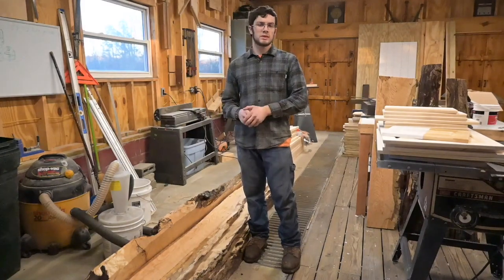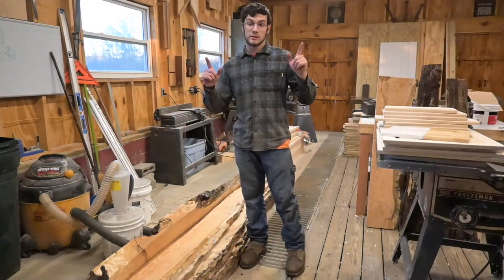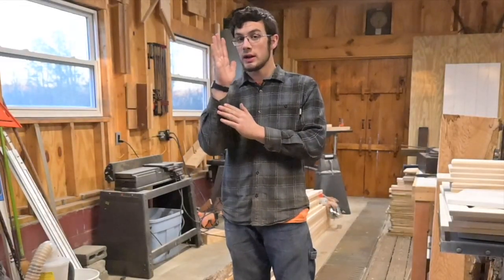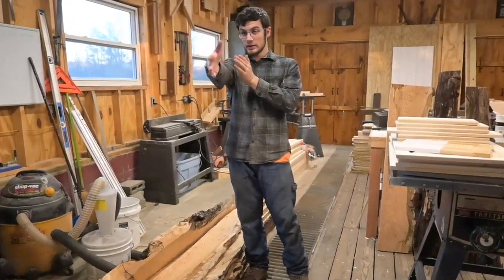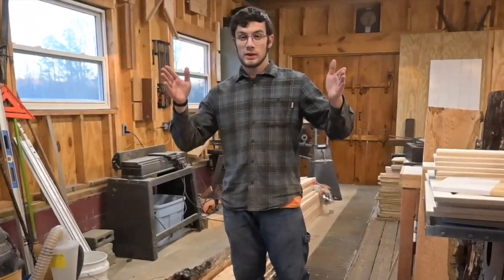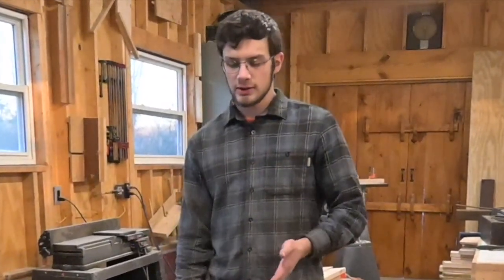Okay, so here come the disclaimers. I don't know what I'm doing. Don't do what I'm doing. This is not a how-to. This is just what I did. A couple things to keep in mind when you're doing it is make sure it is flat up against your board on the side you're cutting off of, and make sure it's sitting flat on the board. That's very important because your blade will go wiggling down there. This one does not cut perfectly square, but if you don't move your boards and you just shift over and cut through your guide board like I did because I didn't care about it, then they stay parallel. So most of these are actually pretty parallel.